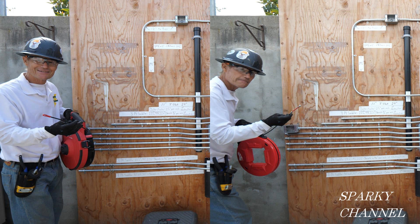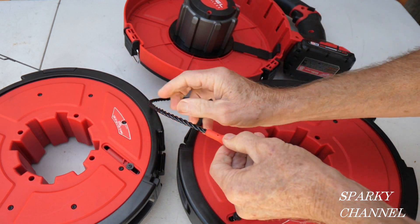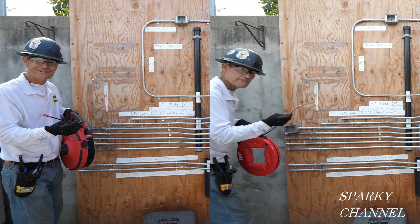Both fish tapes will feature 100 feet of three-stranded polyester fish tape line. This is a long awaited event. It features 640 degrees of angles to get that fish tape and three 12-gauge wires through. There will be a black hot wire, a white neutral wire, and a green ground wire, and they have to be pulled through the entire course.